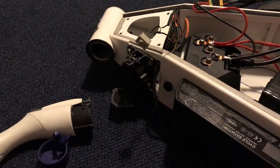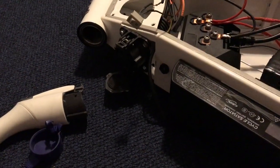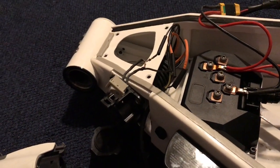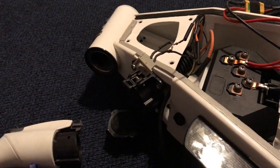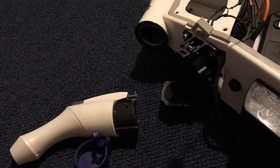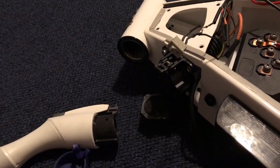You can find the standard on Wikipedia for SAE J1772 — that's the standard for how this particular plug works. The way it works is it essentially passes AC to these two orange cables in the back, and in order to tell it what to do, it is controlled by a variable voltage. That voltage comes in on pin 4 of the J1772 plug, and the EVSE measures the voltage between pin 4 and ground to determine what to do.